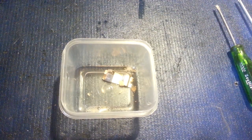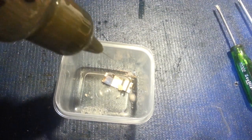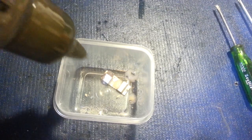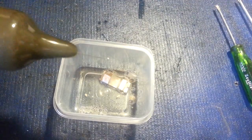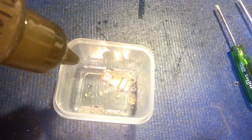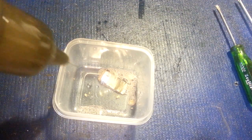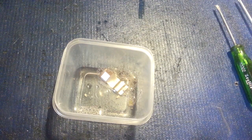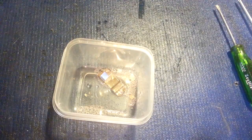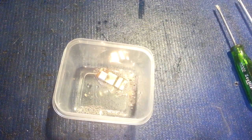We take our little bottle of vinegar and dribble some on. You can hear that fizzing — it's neutralizing the alkaline residue. This is a very mild acid; it's vinegar — you eat it, you can drink it, it's not going to hurt you. But it is nonetheless an acid, so it cleans off all that crap. Once you're done, since it is an acid and can itself cause some corrosion, just scrub it off with an old toothbrush and water — that'll wash it away and it'll be good as new.